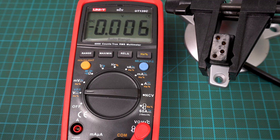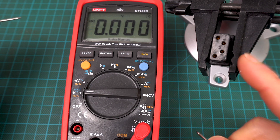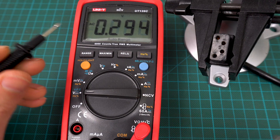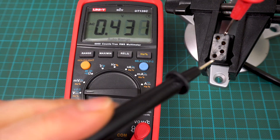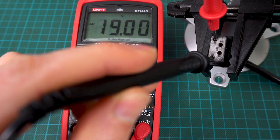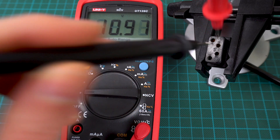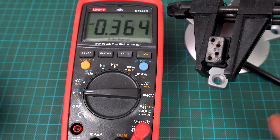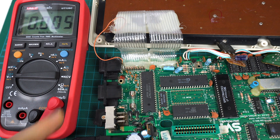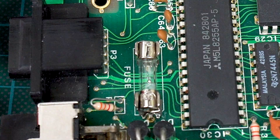Since there are so many things wrong with the board, I'm going to make sure we test the power supply first — especially because we saw the fuse being blown, which could indicate something wrong. This power supply outputs two kinds of AC voltages: across the top two I think is 16 volts, and across the bottom one there's nine volts. That's 19 AC — probably good enough. The lower one is 10.8 instead of nine — again that's probably fine; with a load this will drop to normal voltage. So okay, at least that's working. Let's do it — what could possibly go wrong?